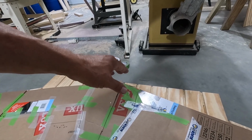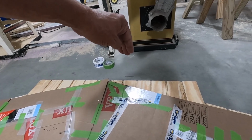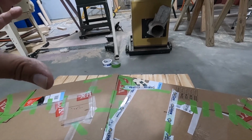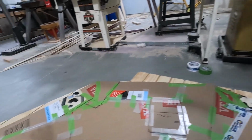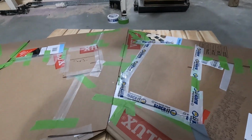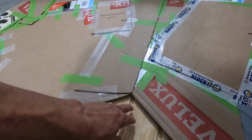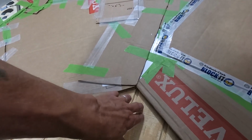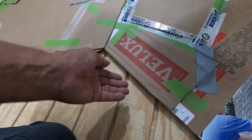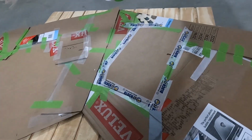When I put this cardboard up there on the building, it was about 1/4 of an inch in from the 2x4s up there. We're going to have molding on that, so it's going to cover whatever's on these outside edges no matter what. But when I figured this out right here, I figured out the truss plus the roofing material, 5/8 of an inch, plus 1.5 inches. I put these on 1.5 inch blocks because this is going to be 1.5 inches off the roof.